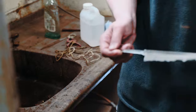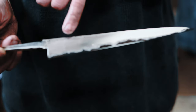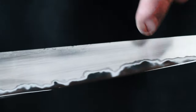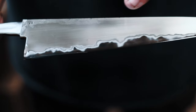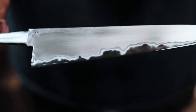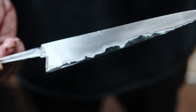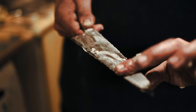Just look at that lovely contrast. One thing I really love about stainless clad is all of this wavy cloudy stuff — this is the carbon migration I was talking about right at the start of this process. Where the dark core is whiter, that's where it's lost a bit of carbon. Where the shiny cladding is darker right by the edge, that's where it's gained a bit of carbon. The dark bit has basically robbed the carbon out of the lighter part. Ideally you don't really want any of that light stuff coming down and touching the edge.